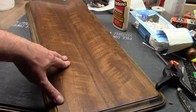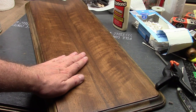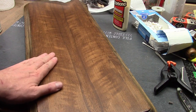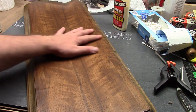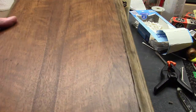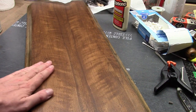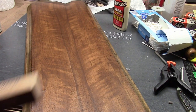Another lovely day where we have 82% humidity currently, so I had to let this sit a good 2-plus hours to completely dry. Look at that — looks great. No milkiness. It kind of gave it a semi-gloss finish and it actually leveled out better than I thought it would. So you really don't see brush marks. I could probably move right onto grain filler, but I am going to give it a light sanding — probably just to show you how I sand.